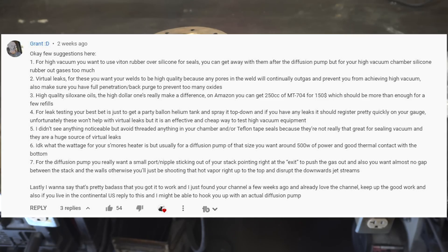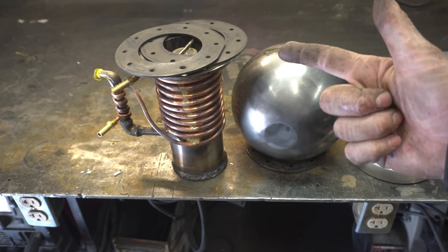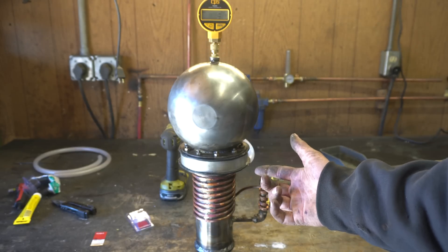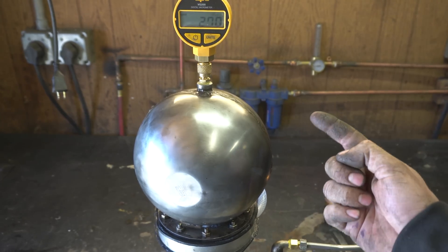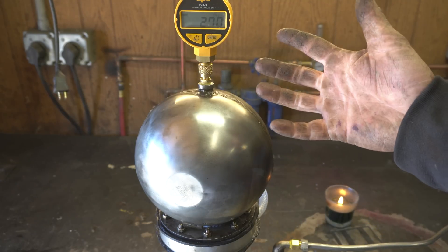Grant gave me quite a few really good suggestions, one of which being to use Viton for the gaskets. So I've made a couple of those on the laser. I'm going to stick this thing together. So I got everything put together — it all seems good and tight. Before actually running the diffusion pump, I'm going to pull just a boring old regular vacuum and make sure it can hold that. Look at that — it's dive bombing quick, that is quicker than the last revision did. I've let this sit for maybe 10 minutes or so and it's still holding at 270 microns, which is superb.